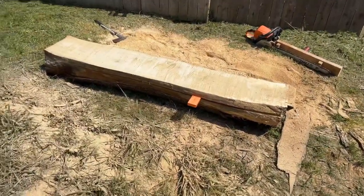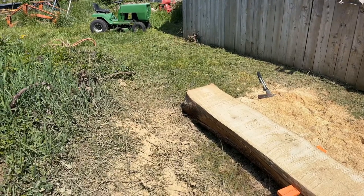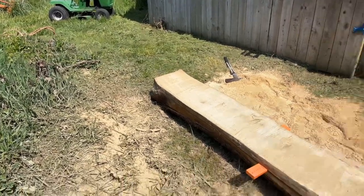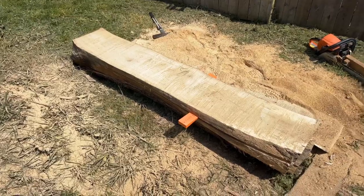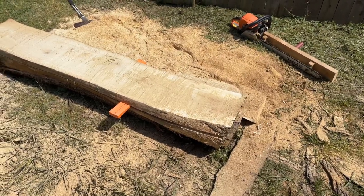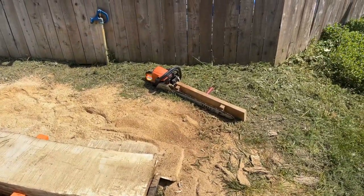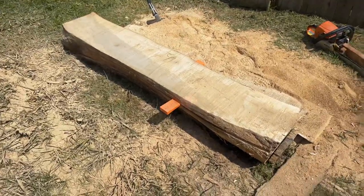I got another slab off of there. I sharpened my saw in between cuts — well, I started into it a little bit and then I was like, it's not going, so I sharpened it at about a 10 degree angle. It cut real well. I left that wedge in there at the end for a long long time and then it started to really bind. I brought the wedges down and pounded them in real deep so it was pulling up on it. When I got to the end it straight up pulled up, and that was great. So it was pinching in my last video, but cutting much better being pried up the whole time. That's a tip for you guys — if you got a saw, just make one of these mills. This thing is so awesome to be able to make these boards.